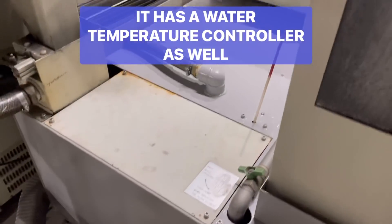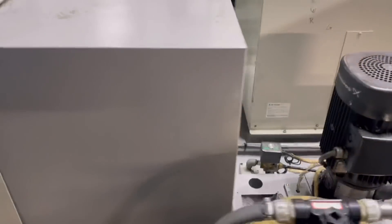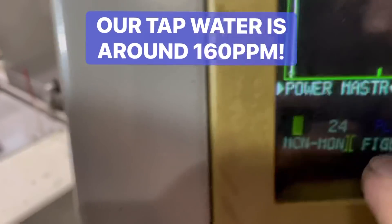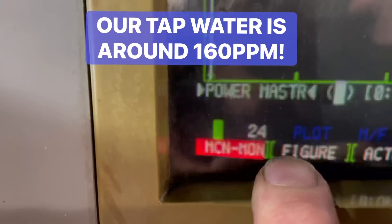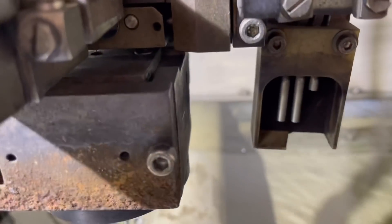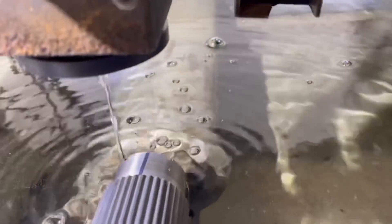This here is the storage tank where all the water is kept. It actually goes through a number of different cycles and filters to remove particles. It also has to meet a certain water quality before you can actually machine — you can see the parts-per-million reading here for metal, iron, and other content in the machine. It has to be low enough so it's not conductive. There's a sensor on it that tells it how high to fill the water before cutting. You can see it coming up over the part and the table — it'll rise to that sensor and automatically shut off, then recirculate while cutting.